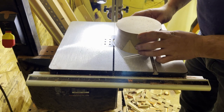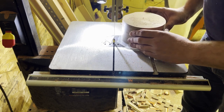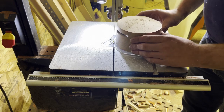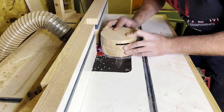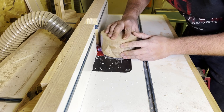The screws are in to hold it in place, and I'm trimming off the excess acrylic with my bandsaw — trying to be careful. Once that's done I take it over to my router table and use a flush trim bit. It just follows the curvature of the piggy bank and gets it nice and flush with the edge.